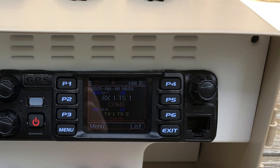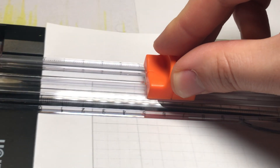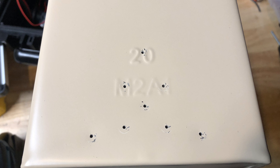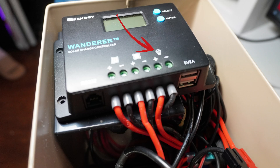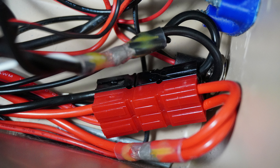While I was waiting for Shapeways to print and ship my part, I used the project tool in Fusion 360 to create a sketch with all the holes for each component, scaled it in Word, and printed it out. Then I just taped it to the ammo can and cut the holes. The wiring is an absolute rat's nest — essentially I connected all the inputs together, plugged them into the solar panel input on the charge controller, and connected all the outputs together through a fuse box, then connected all the outputs to the solar charge controller output. I left the radio directly connected to the battery, since it probably draws more current than the charge controller can handle.